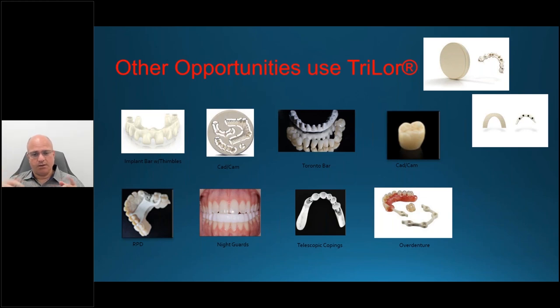The glass fibers go in 360 degrees in multidirection, held in a 25% composite matrix. Within the same class of polymers, the fact that Trilor is reinforced with glass fibers puts it head and shoulders above the rest. Trilor is the only one with glass fibers reinforced in a high-performance polymer. The second question is about bonding. Cleanliness is most important. You sandblast the entire surface of the Trilor material — primarily for cleaning it and removing oils and debris. Sandblasting removes that very thin top layer so you have a clean, pure surface.